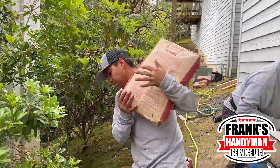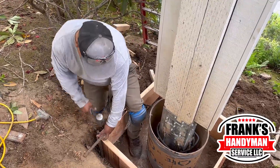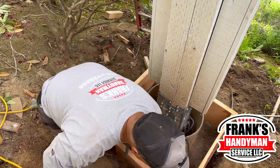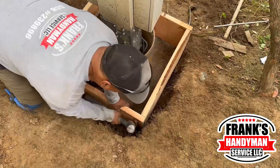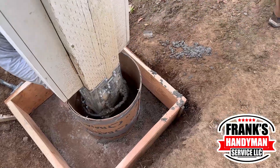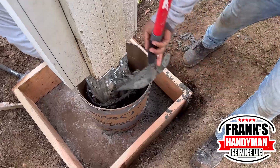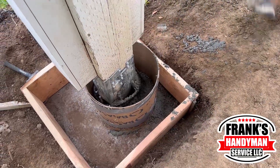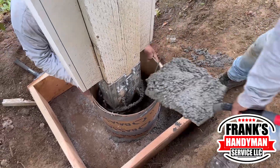Also we have another one. After getting everything in position, right now we're gonna mix all the concrete — we're gonna add some water and do it right there in the cart so it will be really quick. We will start pouring it inside. As you can see, we will add some rods over there so the box doesn't break and so it remains in the same place.